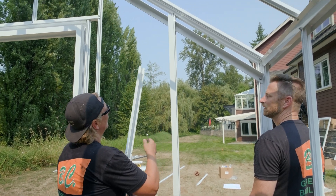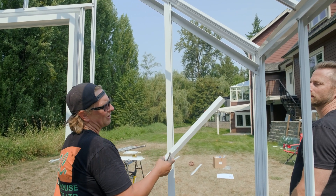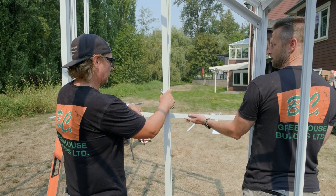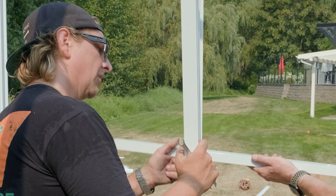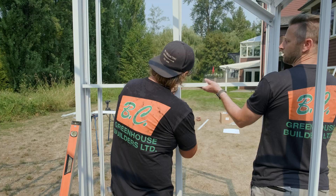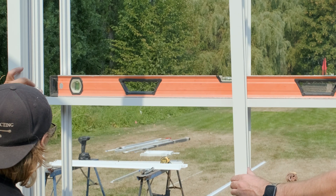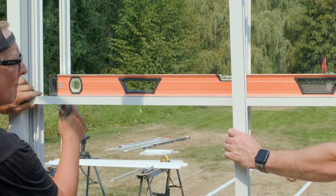So we'll get a post in the gable and then we'll get a horizontal brace that's an inch by two and a half, or inch by two. The way I do it is kind of easier with two people. I'll set this and have someone hold the brace. Put your bolt through, set this post first — that will set your height. Get a level on your bracing and then pin it off.